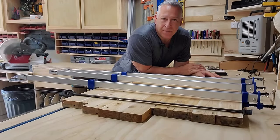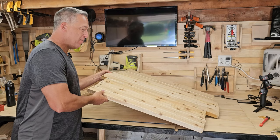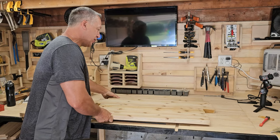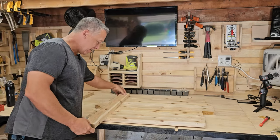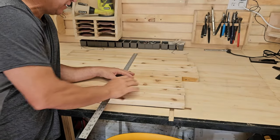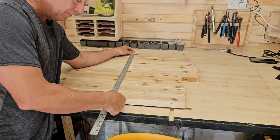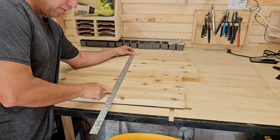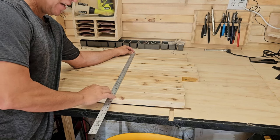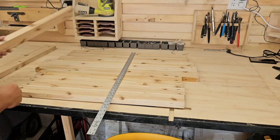I got everything all glued up. I'm gonna wait for this to dry and then we'll cut them down. I got my board out of the clamps — now it's one big piece. I'm ready to trim it down to its proper size and then add this board on the ends. All the milling down on these boards to try and get them as clean as possible. I'm at 25 and three quarters. We already determined that the base is 24 and a quarter, so that'll give us three quarters of an inch of overhang on both sides. I want to keep it square, so I want to make sure that this end is also 25 and three quarters.